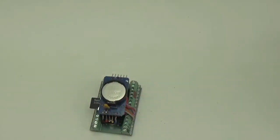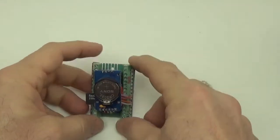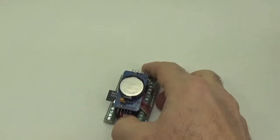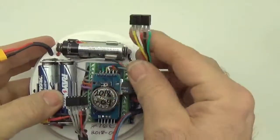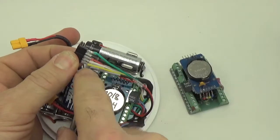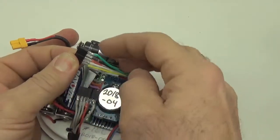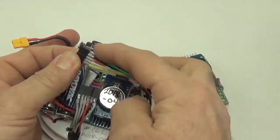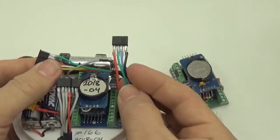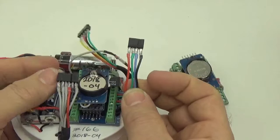Alright, so the next step is to add whatever wires we want for the various breakouts, and this varies depending on what you're connecting to your logger. And as an example, here I've got an I2C connector, and I always use the yellow, white, red, black color standard for my I2C buses. The yellow's the clock, the white's the data, and then power. In this case, there's also an alarm line. Whatever sensor I was hooking up had a 5th wire, so that's a 5-pin connector. There's my LED connector. So red, green, blue, and black. It's a common cathode LED, so it just has one ground line.